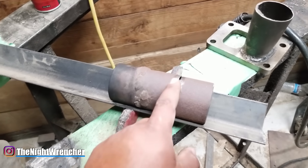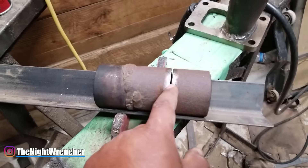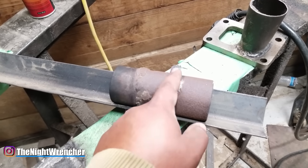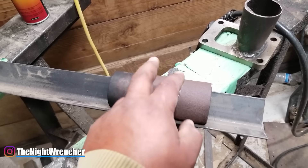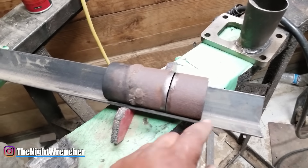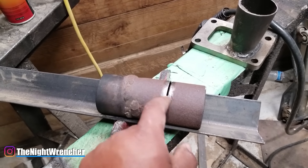The second thing you need to know is that you've got to get rid of all the gaps. Thin metal blows through really easy. When you have a gap — typically a 16th of an inch — that wouldn't be very difficult to fill on thicker metal, but because it's thin metal, by the time you try to bridge both sides, you've already spent too much heat and soaked it into the metal. Everything's just going to drop inside. You need to support the two pieces of metal next to each other and close these gaps to essentially nothing — that'll prevent the metal from getting too molten and falling into the pit.